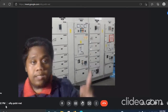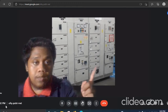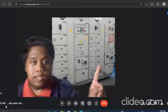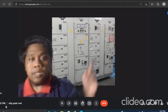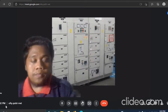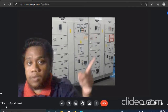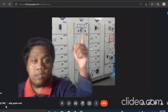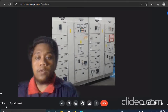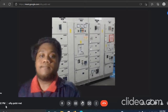Okay, if they are ready, first of all, we need to turn on the power factor capacitor down here first. We turn it on by just pushing it like that. And after that, we will turn on all the other loads. By doing that, load 1 here will be given supply from MSB2. Okay, that's all from me. Thank you for listening on MSB1 and MSB2 coupling.